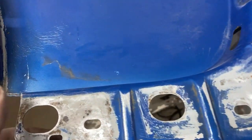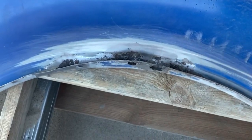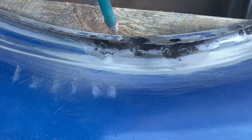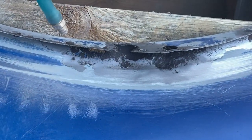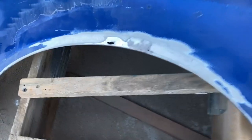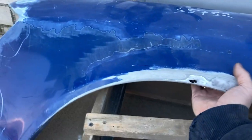I also made sure to remove rust from the lower parts of the component as much as possible. Preparation is the foundation of the entire work, so it was important to minimize the presence of rust. I made a small sandblasting device with a flexible hose to reach the back side of the edge. I managed to remove most of the rust particles, but manual methods were still more effective in some cases.